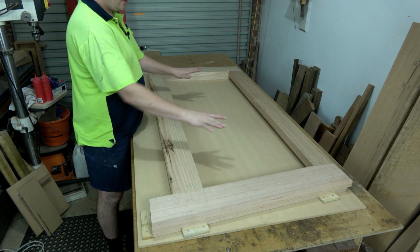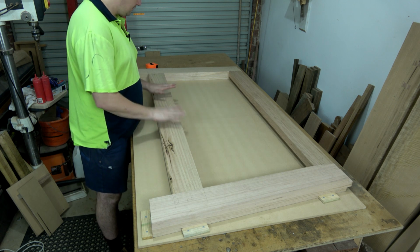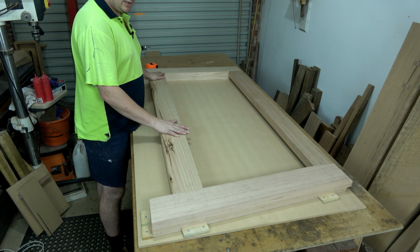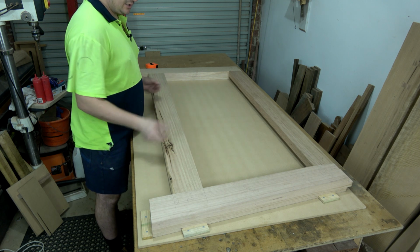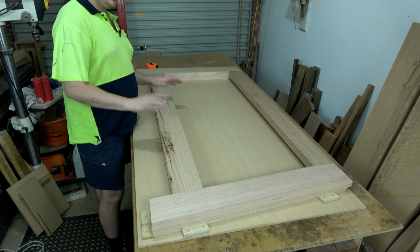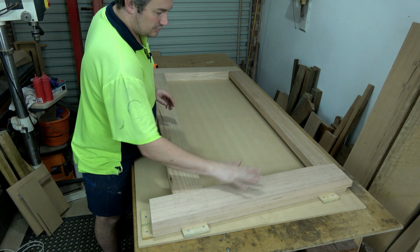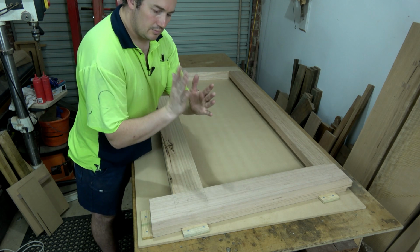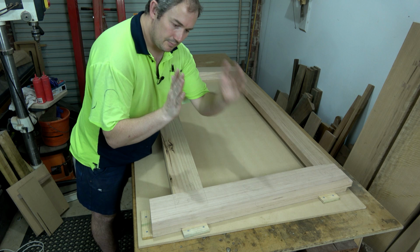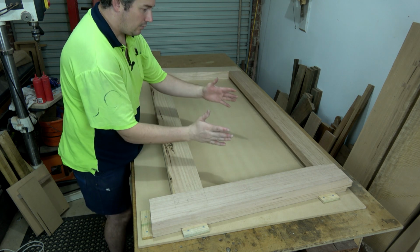Alright, so with this front frame held in this template, being held square, all in position, everything's good, we can now build our rear frame the exact same way, except we're going to locate things from our front frame. You just got to make sure that you're not going to put your left leg on top of your right leg, because this is the right leg. You want to make sure that you've got a mirror image, that you got your front frame and you move your back frame back here, and they're all exactly the same, in case this is shifted that way or that way.